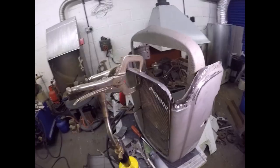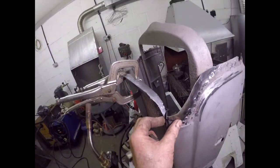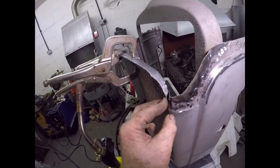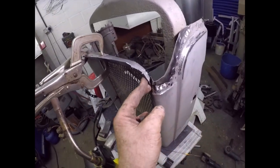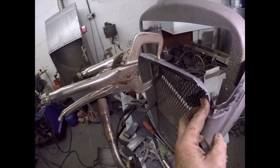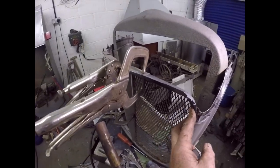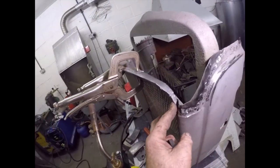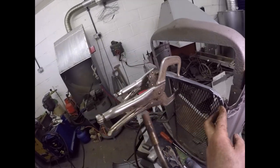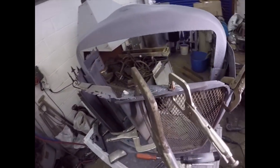It's 3:30 and we have a piece that approximates what wasn't there when I bought the tractor. It fits — it'll weld and tap, the grille fits perfectly, and the top fits perfectly. That's the second piece made. I'm now going to clamp that in place without fouling the top, so I can offer the top piece into position, check it's a fit on the inside, and then it's weldy weldy.